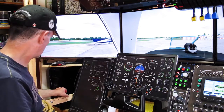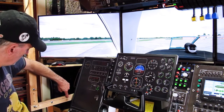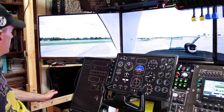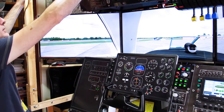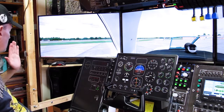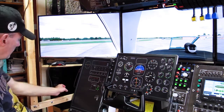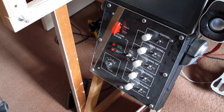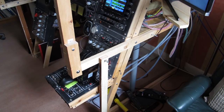One other thing that came to light during the work: I noticed in this cross-piece here there's a bit of a crack developing. It strikes me that quite a lot of weight is carried by this — it carries one end of all the weight of everything overhead, supported at two positions: one here on this cantilever and one at the back. That looked like it might fail at some point, which is why I've added a vertical member here that goes straight down to the ground, and one on the other side. That should stop the crack from developing further.